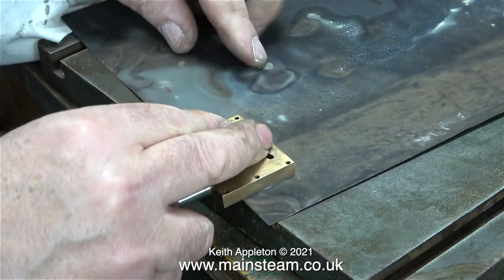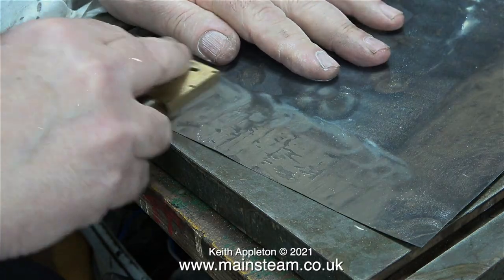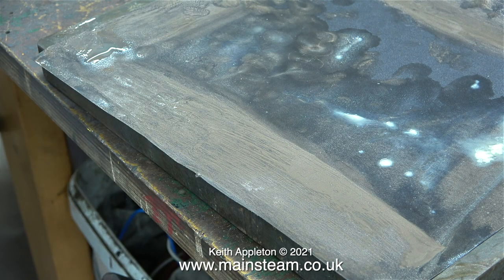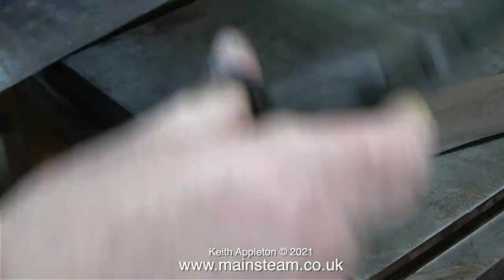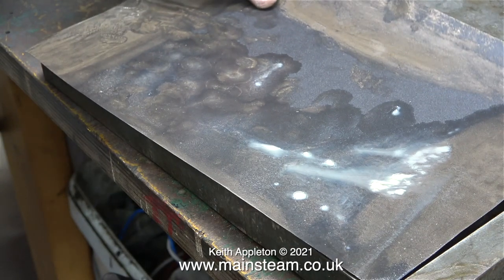The rough stuff removes slightly more material and there isn't much scoring left to get through. Here's a top tip: the wet-or-dry sandpaper starts off fine but after a while it doesn't cut so well. A good solution — after I'd used all four sides, the middle bit was still all right, so I simply cut away the worn parts one side at a time. That left me plenty of fresh sandpaper area to continue doing the job.